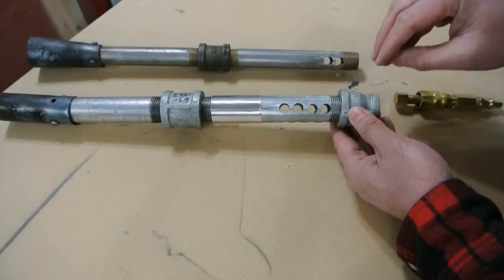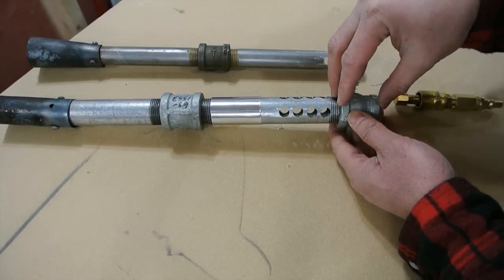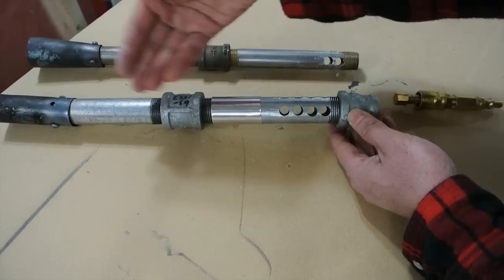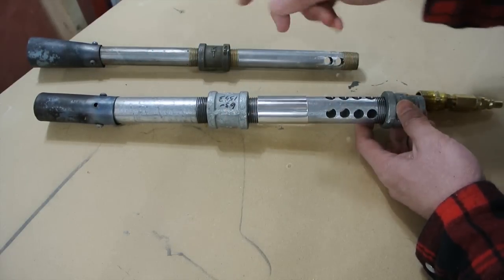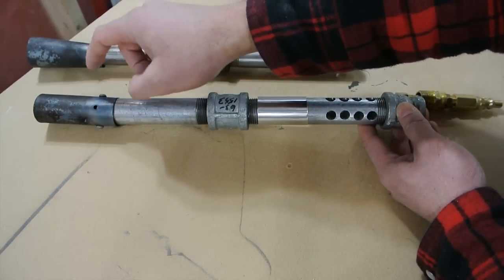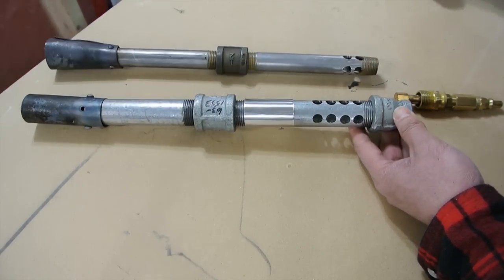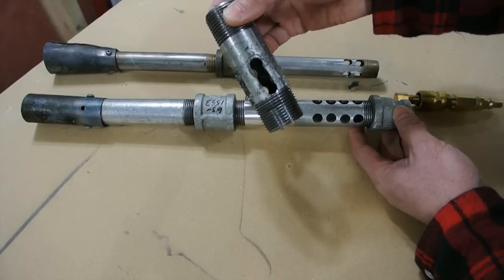This is a one-and-a-half to three-quarter coupler — or reducer, I should say — and then a three-quarter inch pipe. This is just a coupler because I couldn't find enough pipe, so it's just to lengthen it out. You could use a full black iron pipe. I've also built a nozzle with some tapped holes, a little more refined than the previous one, and eventually I might move up to something larger when I can get some proper pipe.